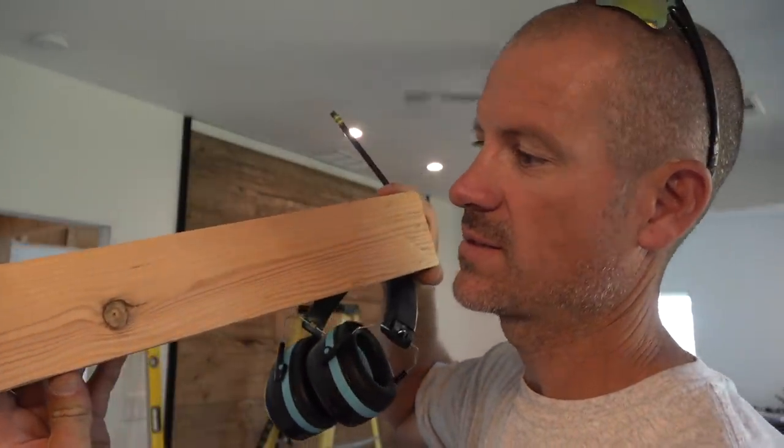All right, we are on our last row, and there is a return vent up there. And these boards are an inch and a half, and that return vent's like an inch, I don't know, 3/8. So I'm just gonna put a board up there, and I cut it down to 1 1/4 inches so it'll fit in between there. But, like I told you at the beginning, this wood, I think, was put up on the farm like 1950s or 60s. So it's really old, and I just cut this. And it's cedar, but you can see how nice that is still on the inside. We're gonna get that up there, and then I have two pieces on each side to cut, and we should be good.